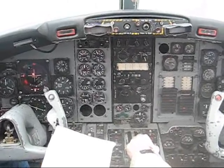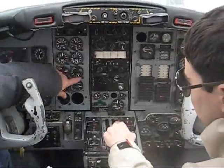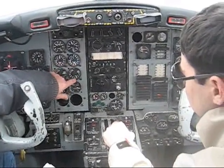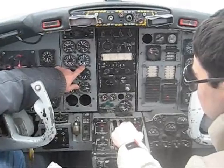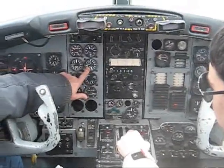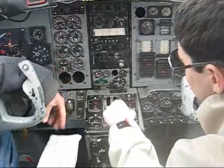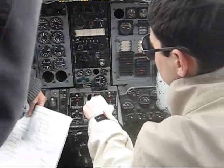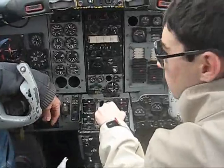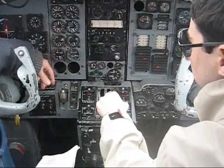When I turn on my engine inlet anti-icing, I'll have to reach up and throw a switch here. What I want you to look for: you're going to see a decrease in RPM, and the EGT is going to come up. It's not going to be a big jump either way - it might be 20 degrees rise here, might be a little decrease here. You've got to get to a steady RPM. I'll throw the switch and you can watch. Here comes my anti-icing - it's on. The RPM's coming down, temperature coming up a little bit - not a lot, but a little bit. It tells you that valve's working. And then when I close it, it'll come back the other way. It's not a huge jump, but it is something you can notice - you can see it on the gauge. That's really the only positive indication that valve works.